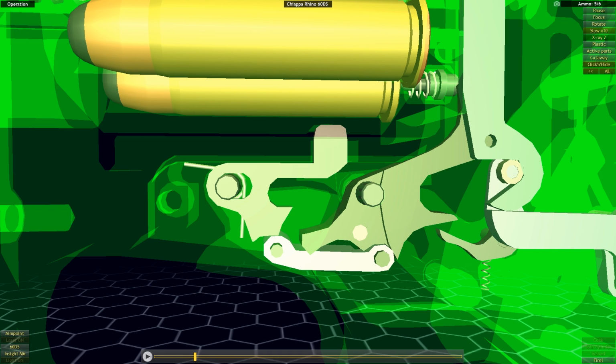Ordinarily, this is not an issue, as the force of a full-strength spring is all you need to bring the cylinder stop up into the locking notches, and the cylinder stop is there mostly to resist horizontal movement that could potentially rotate the cylinder rather than vertical movement. A possible issue occurs if the spring has been weakened over time due to use and wear. With a weaker spring, less energy is being applied to force the cylinder stop upwards, and a sharp jolt, such as during recoil, especially in harder recoiling revolvers shooting powerful loads, can counteract the force holding the cylinder stop in place, potentially allowing the cylinder to freely rotate during the firing of the revolver. To counteract this, the Chiappa Rhino uses the link to hold the cylinder stop in place while the trigger is being held in, the time that recoil is most likely to occur.